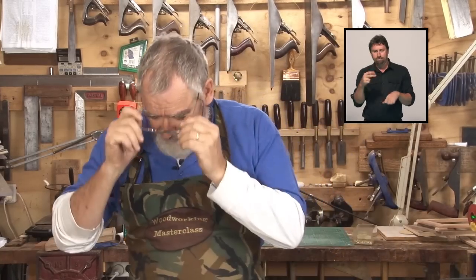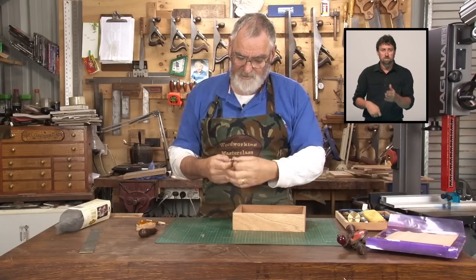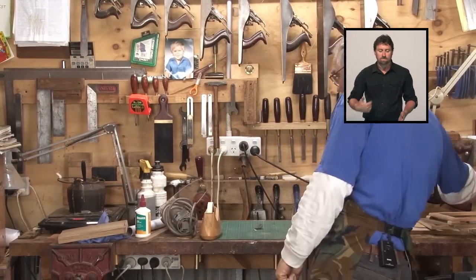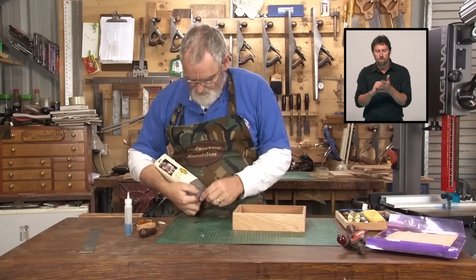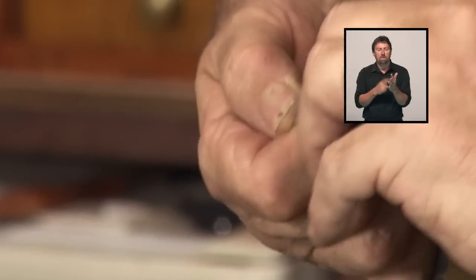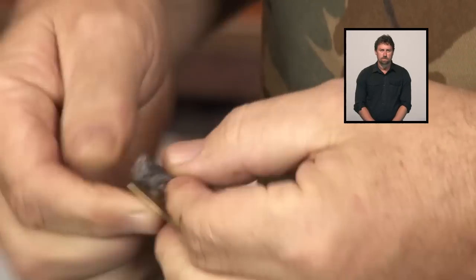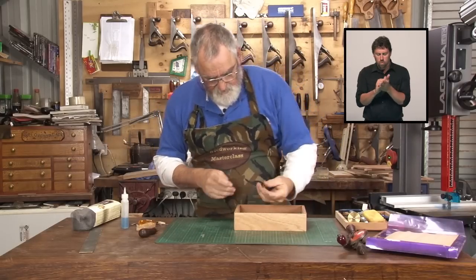Big problem with hinges, oh, not a huge problem, but something that really annoys me, is when you pick them up, and these just came from a normal hardware shop, they're 1-inch solid brass hinges, they've got all these annoying stickers on them. So all you need is, where is it? Oh, a bit of kerosene, a little bit of 4-0 steel wool. And just give it a good polish. I like that, it's a really fine steel wool, that's good quality. And I think this one's okay.